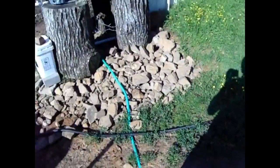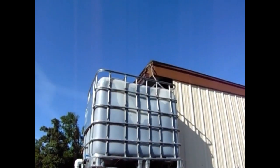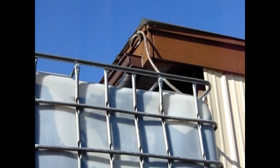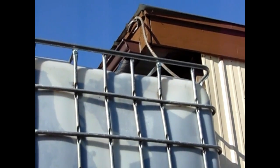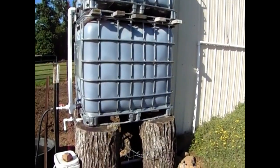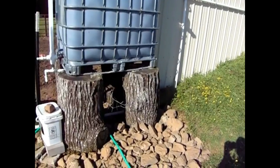On this one here I did not have a gutter guard system in place, so what we put on there is just a quarter by quarter hardware cloth over the top of that to strain what's coming in. Then on our inlets to our chicken waters, we take an aluminum screen — no different than the aluminum screen you'd use for your house — and we use that to basically make a small screen in the hose.